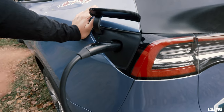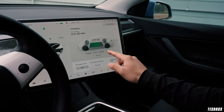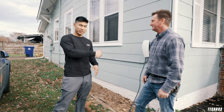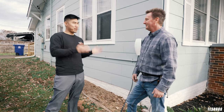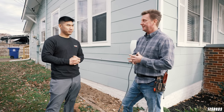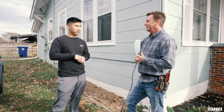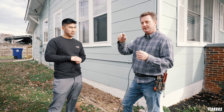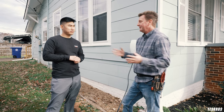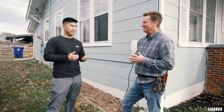We got the green light! We're getting 16 amps right now — 11 miles per hour — and it's going to ramp up to 48 amps. We're good! Thank you so much Michael — no hiccups at all. Michael's tip for anyone about to get a charger: make sure you have room for the breaker and the capacity in your panel. At our warehouse, Michael had to move breakers around — you can use piggyback breakers or mini tandem breakers to create space inside the panel; they're code-compliant and factory-approved. Or if there's truly no space, you have to add a sub-panel, which does cost a lot more money.